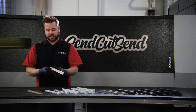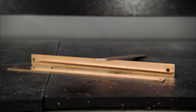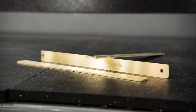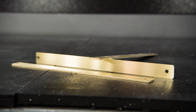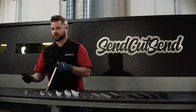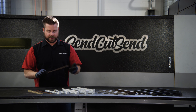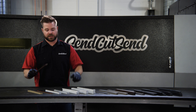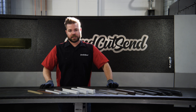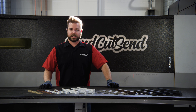Finally, let's get to some of our red metals — copper and brass. Copper and brass have very similar edge qualities and characteristics to stainless: very very smooth finish, no dross, both cut on oxygen. However, the surface is incredibly soft, so if you look at it wrong it tends to scratch. We always ask that you keep in mind you'll likely want to post-process it — hit it with a DA or some Scotch-Brite. We offer free deburring, so if you want a brushed finish we can do that at no charge. If you opt out of that there will be some scratches. That's all I have today for edge quality and surface quality. If you have any questions, email us at support@sendcutsend.com or visit sendcutsend.com. Thanks guys!